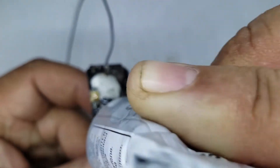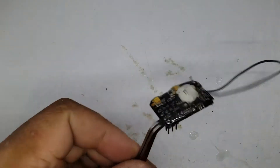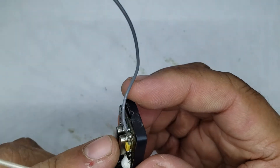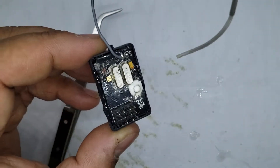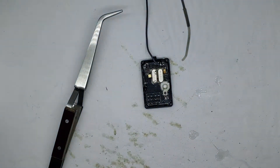Give it a good coat — you don't want a super thick coat. See how it's starting to get thick? Move the glue all over the board, right to the edge. Cover all the circuits, all the capacitors, all the connections — everything. The reason I say don't put it on super thick is because when you put the case on, it'll squeeze some out, and when it dries it actually shrinks. So while the board is still wet, take the case and stick it on. Some glue will ooze out a little — that's okay, just slowly wipe it off.